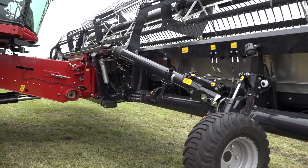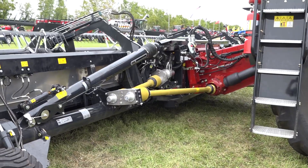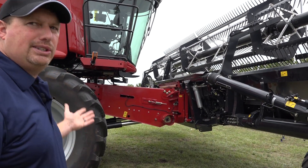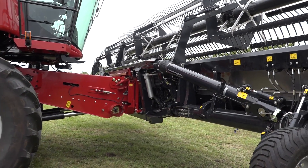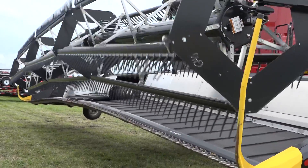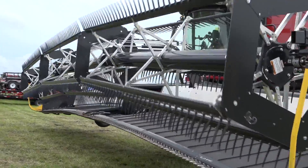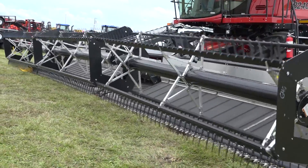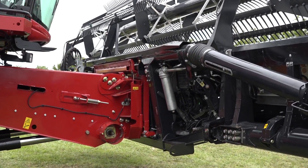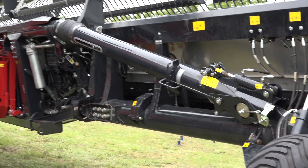As we look at the back side of this head, it's where we set ourselves apart from most competitors on the market. On either side of the feeder house, we have a hinge point that allows our wings to flex up and down — we've got 12 inches of flex up and down out at the end of each wing. But what really sets us apart is we don't use a big center adapter. Our head mounts directly to the combine just like a normal flex head would, and then we use a torsion spring — the big bar that comes down has a torsion spring inside it — and that helps us balance the head side to side.